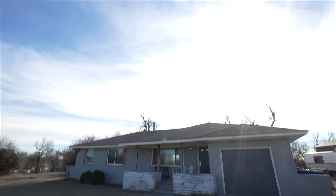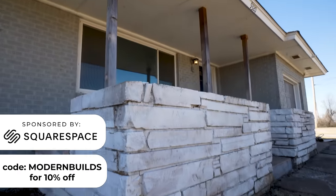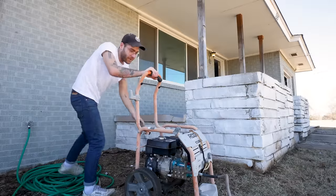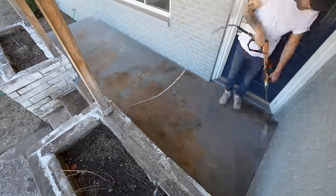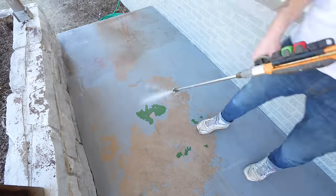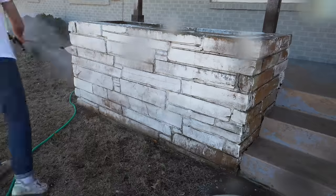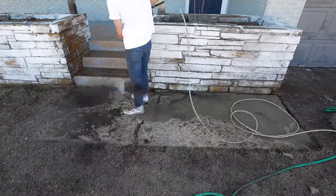There's a lot to do on this project and our goal is to get the best result possible while sticking to a smart budget, which we'll break down at the end of the episode. Our first step is pressure washing. I'm going to hit all of the concrete and get as much of the existing paint off of the porch, and also try to get rid of this whitewash coming off of the planters, being careful not to damage the mortar or any of the stone. If you don't have a pressure washer, it's something I definitely recommend getting — you can see it working on the sidewalk too, removing dirt, debris, and loose gravel.